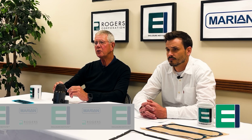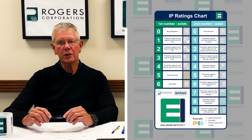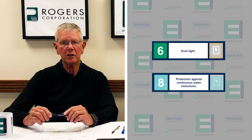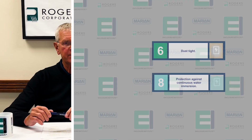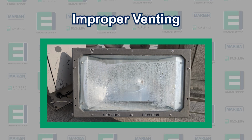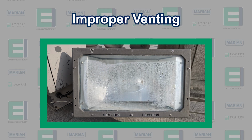The last cause for gasket failures that we'll discuss today is related to insufficient venting in the enclosure. This is a topic we'll take a closer look at during a later blog and video. Many sealed enclosures that are IP rated for IP68, for example, will experience pressure changes in vacuum or pressure buildup within the enclosure. This can cause multiple problems for the device, including moisture and humidity. The changing pressures can cause seal deformation and leakage, and you guessed it, failure. Without proper venting, repeated expansion and contraction can stress the gasket too much and compromise the seal's integrity.